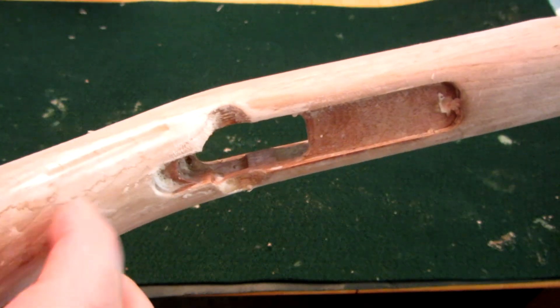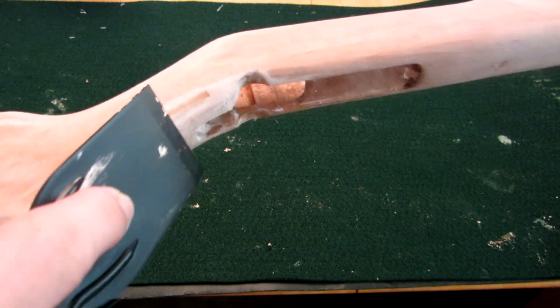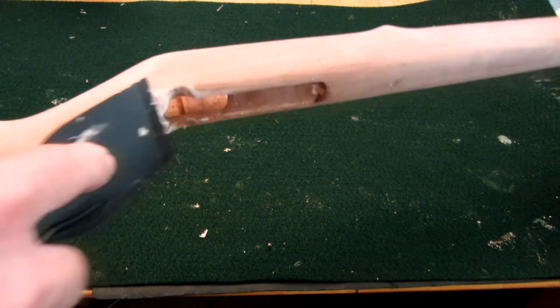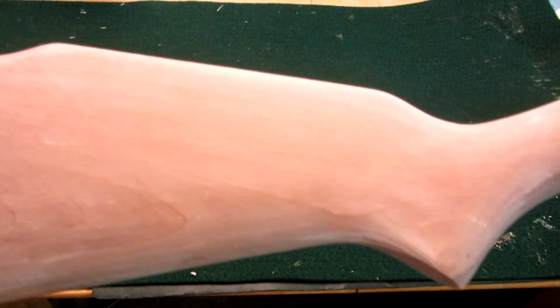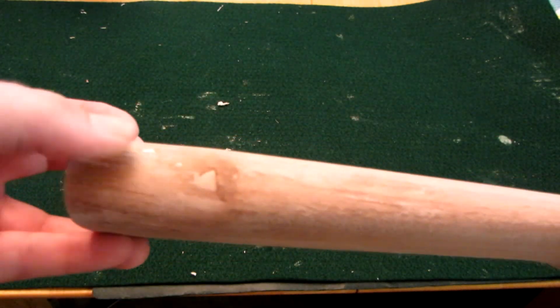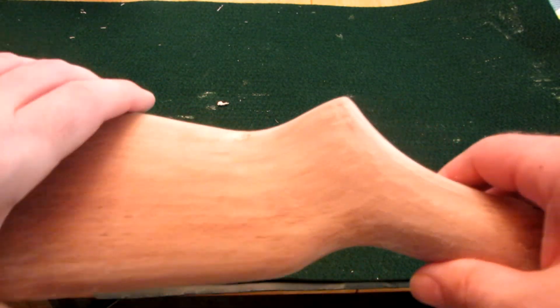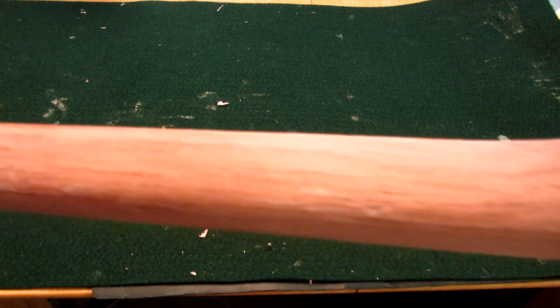There's some residue here that I can scrape off. I'll just pull a plastic scraper out and scrape that off to show you that if you do happen to leave some of this on too long and it dries, it can be removed by doing a little bit of scraping. I just scrape, wipe it down, scrape, wipe it down, and then reapply the stripper as needed. Near the butt we have a little dark area — I covered that a couple of times with Citra Strip and the color didn't change, so I'm assuming that's just a natural part of the wood itself. At this point I'm done with the stripping part and I want to move on to the next phases of refinishing.